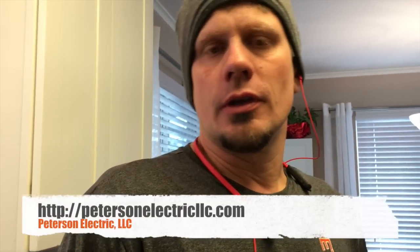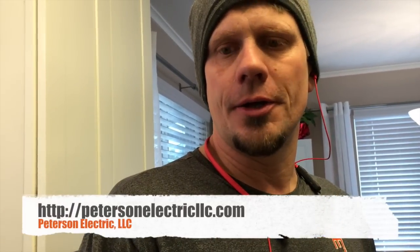Hey guys, Joshua Peterson here with Peterson Electric, in a customer's house today. I want to talk about kitchens. In the last 13 years on my own remodels, I've had three kitchens fed with one circuit. This one had about two max — really quirky. This house was probably built in the 60s, and the kitchen was remodeled in the late 70s. I still have cloth wire, with a ground in some and no ground in others. Then it was remodeled again before they sold, probably five years ago — the cabinet look and the granite.